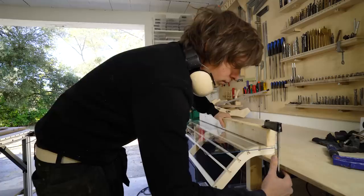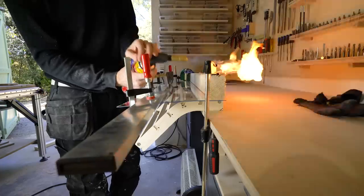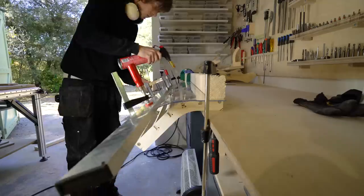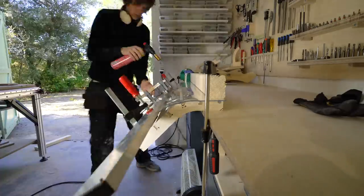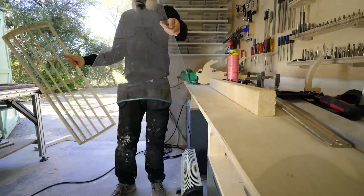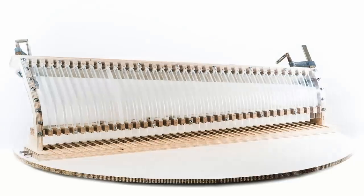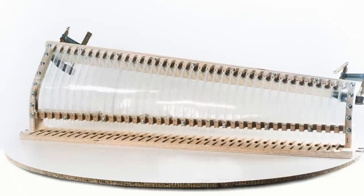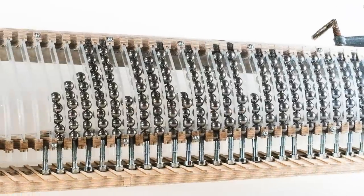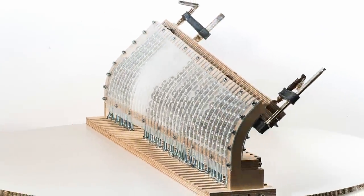So I made a jig to bend the poly in the correct curve, because when you heat a material up like this it will expand, so I had to bend it first and then make the CNC operations after it was bent. And this added some extra challenges. I didn't get the poly perfect, but I got it close enough, for now anyway. I want the marble divider to look like a bubblegum machine with some candy marbles flowing through it in nice rhythm, so I really wanted this transparency look from the polyacrylic.